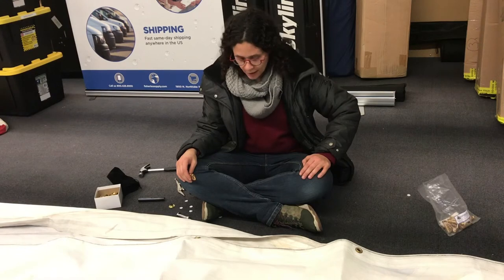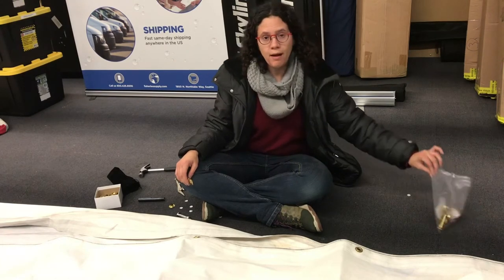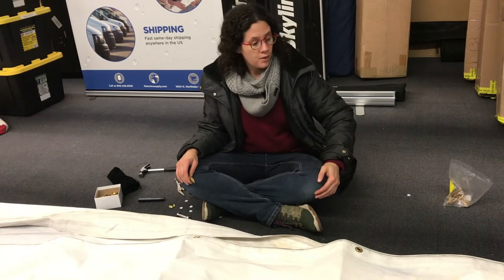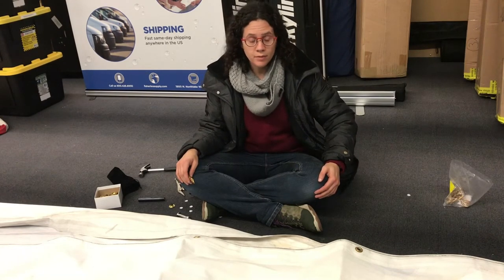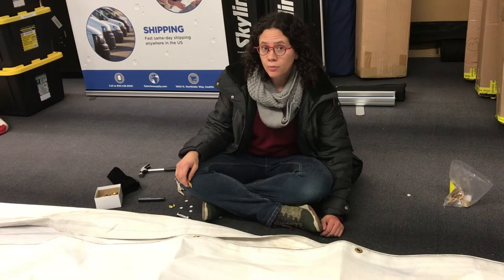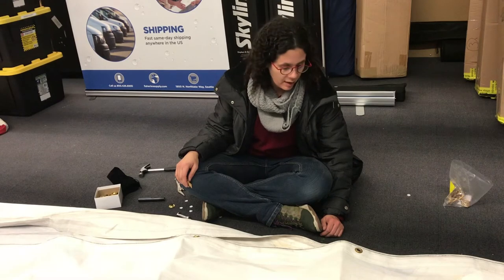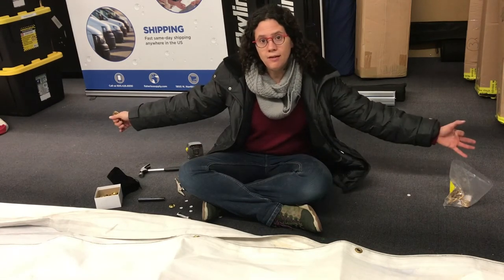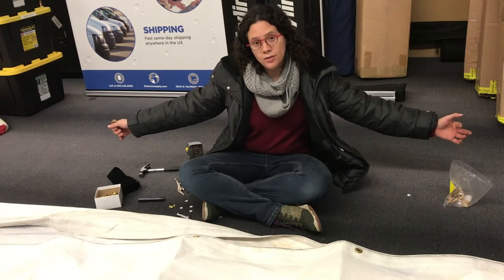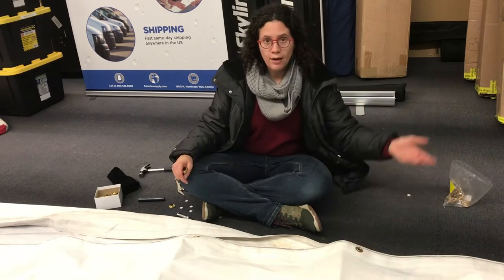So right now, I am going to skip every other grommet, because at Fishery Supply, we only had 10 jib snaps in stock, and I wanted to distribute them as evenly as possible. I'm going to have something in the other grommet. Like, I'll probably for now just tie some thin rope around the forestay, just so I can get the boat home and have the load of the sail distributed as evenly between as many points as possible, so that no one point is going to fail or no one grommet is going to get torn out.